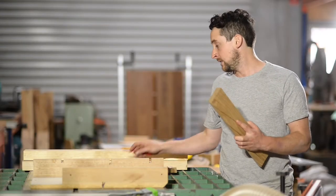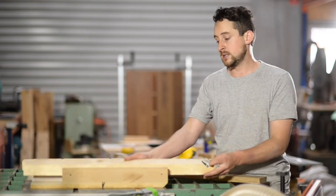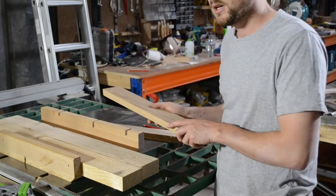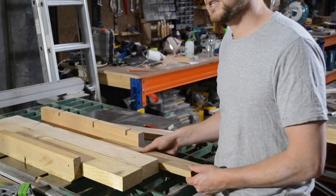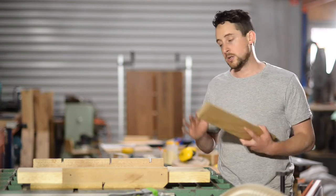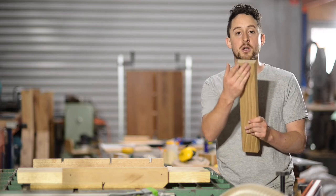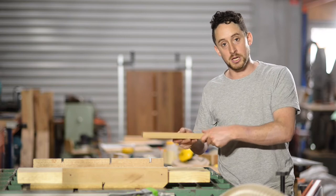This actually works really well. I've done most of them already — I just have a few more to go to show you. I put these spacers on my cross-cut sled so my stave can't go anywhere; it can't get pushed around by the blade on the table saw. It just fits in this slot and goes exactly where I need it to go. I clamp this whole thing down, go slow, turn on the dust extraction because you're creating a lot of dust. And I'll finish off the last couple of these. Obviously remember you're trying to curve the inside, not the outside — so place your staves down in this jig accordingly.